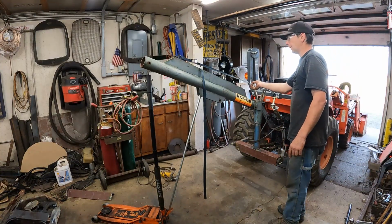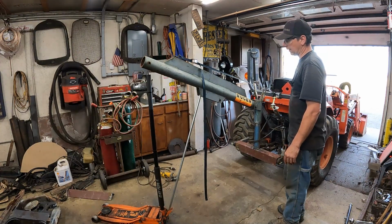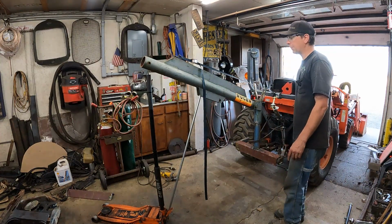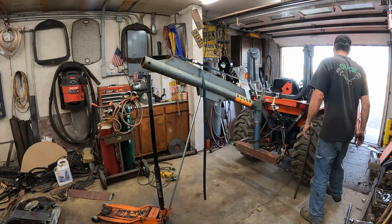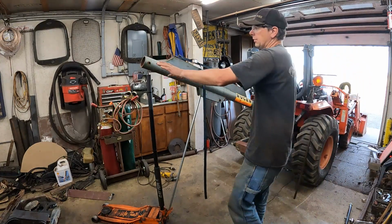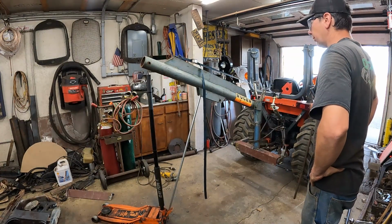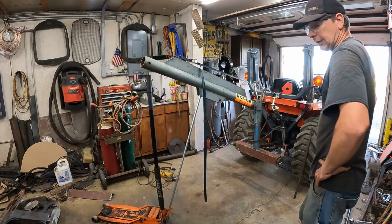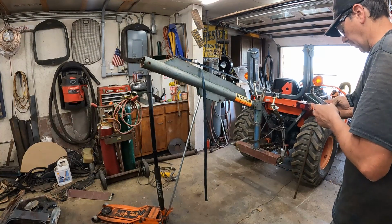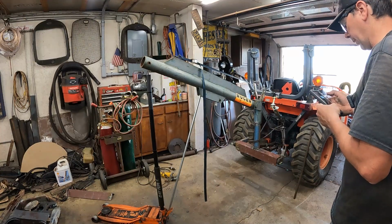This thing is taut, and even to hold it, the lever arm is stretching that pretty good, so I got it jammed here with a piece of conduit. But this is probably about the right angle. Like I said, I'm almost picked up. But I got the second piece of the boom that's going to come out here, so maybe I make the angle just a little bit higher. Should look at the picture. Got pictures for reference. Why I'm doing this is I've got to move a bunch of my engines down to my pole barn for storage, and I need some way to pick them all up one at a time.